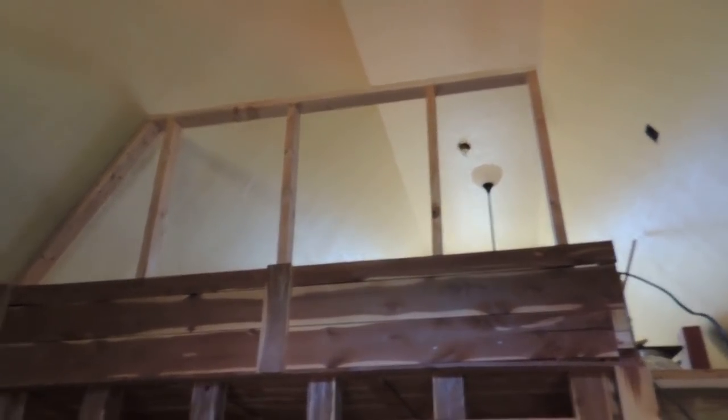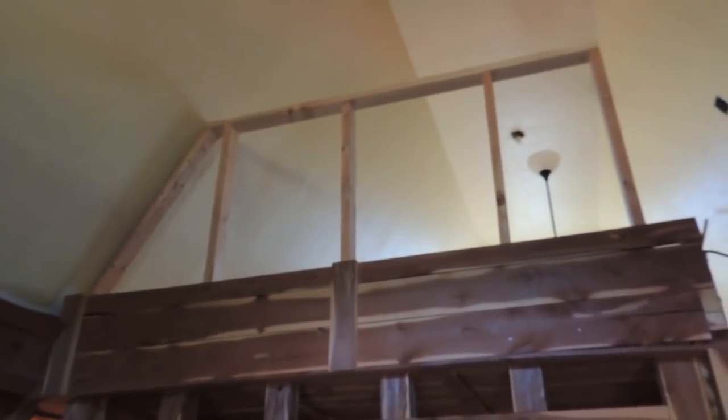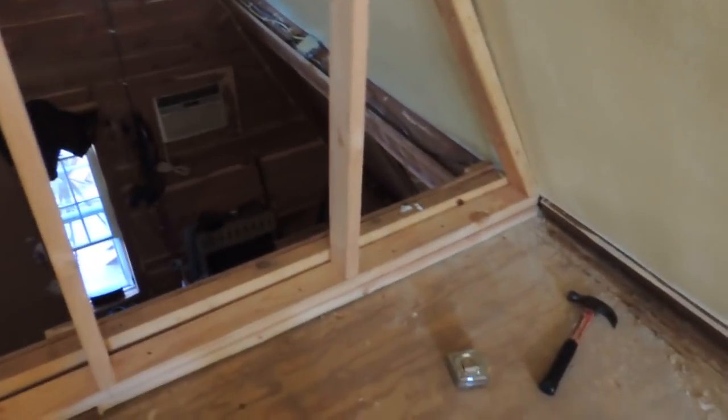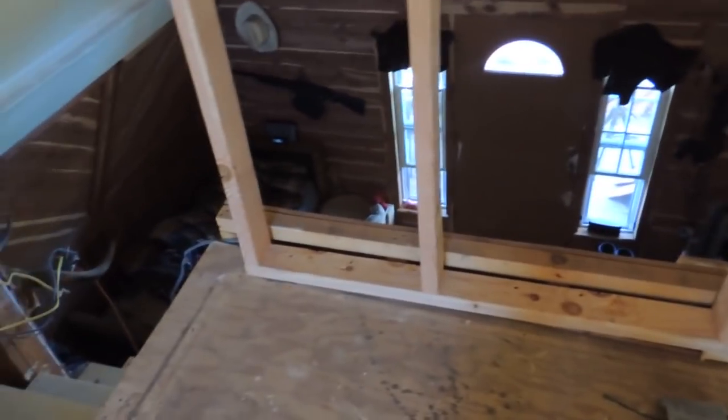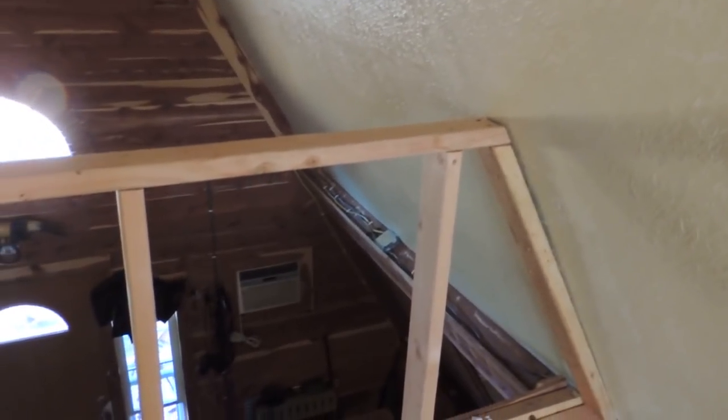I got the framing up for the first rail — that was a butt kicker, a lot of hands-and-knees work. That loft is so unlevel because when I gutted it a lot of it sagged, but it ain't gonna sag anymore because there's beams everywhere. It's level now and that's gonna be covered with cedar slats — I'm not doing any PVC or wire. You can see how far out it was. There's actually a 2x4 under that end and it is perfectly level now.